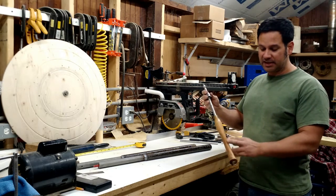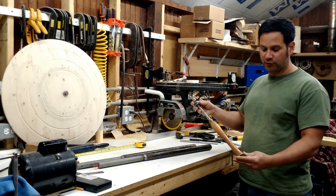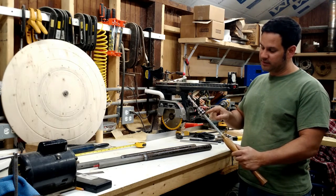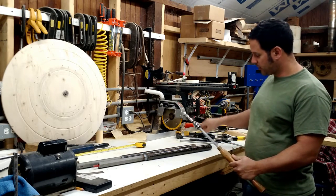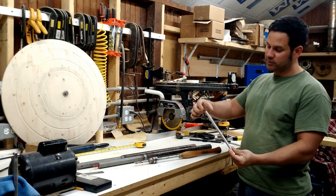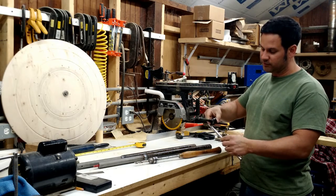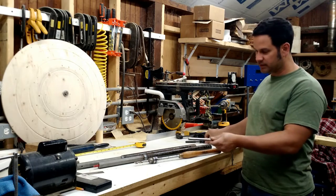This is an original Robert Sorby handle from my very first Sorby gouge — about 20 years ago I bought that. This is a piece of half-inch rod that the end of it was turned down to three-eighths. I took that rod, similar to this rod right here, and just imagine that the end was a little bit smaller in diameter, about three-eighths. I put it in a vice and I took this die and I just threaded the end of it, about a half an inch or so, just threaded it down to fit that chuck.